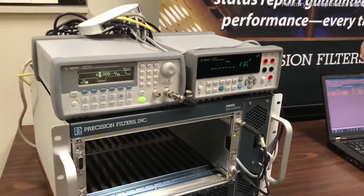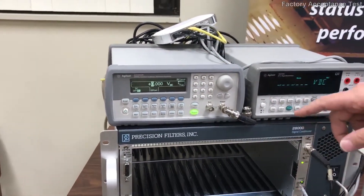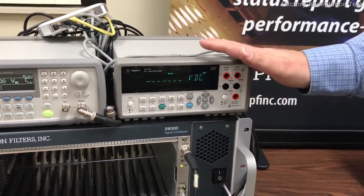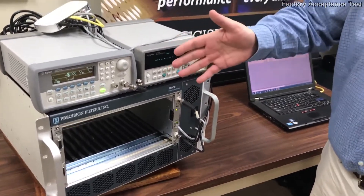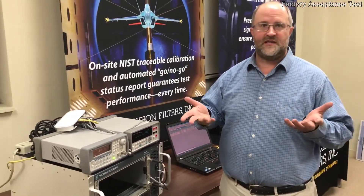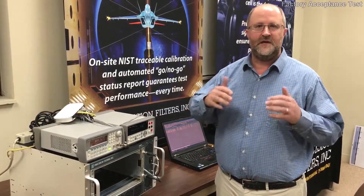In addition to the BIF card, we use two external test instruments to run the FAT calibration test: an Agilent function generator, which we use to generate signals that we inject into our test bus, and an Agilent DMM that we use to monitor the output signals. We inject signals with the function generator, run them through the amplifiers, use the monitor to look at the amplifier outputs, and then measure the monitor output with the DMM. Using this test methodology, we do a V-in and V-out measurement, and using a ratiometric measurement we are able to determine amplifier gain, filter response, excitation supply levels, and all other functions of the card.